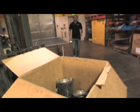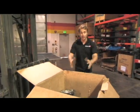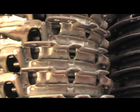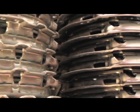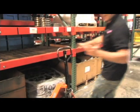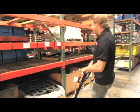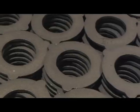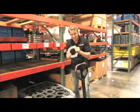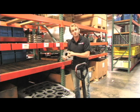I'm surrounded by raw materials here at ACT, and this is how they arrive in a big brown box. This is a clutch cover stamping, which is pretty much ready to go. All it needs is the trademark yellow coating, and then it's ready for assembly. It's pretty cool stuff. Some other parts arrive like this. These are ductile iron face castings. Now they meet SFI specifications, which means they're considered safe to go racing, but they're not quite finished yet. They still need to be machined in-house, and that's where Steve comes into play.